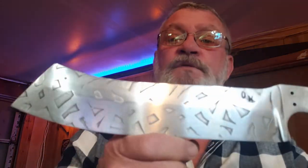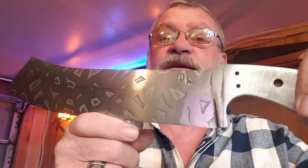We finally got all our sanding done after we etched it. I put up the video yesterday, I think, of doing all that hand sanding and everything. And I didn't show in the video, but I went back and sanded it a bunch more yesterday. I did 800 grit, wet sanded it with 800, and just cleaned it up a bunch more. But here's what we've got. So that's the way it's gonna look with the etching and all the sanding done.